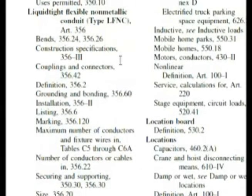Non-metallic means you have to have grounding and bonding. Now, you used to be able to have what was called a mechanical ground, where if you had metal conduit, that would be allowed to act as a ground. Then they changed the code and you had to always pull a ground wire, with certain exceptions. But if you have non-metallic conduit, it's non-conductive, so you know you're going to need grounding and bonding.